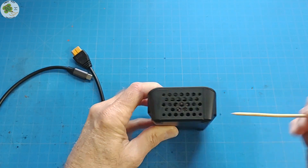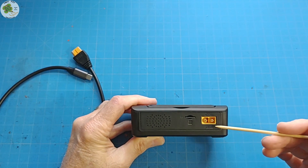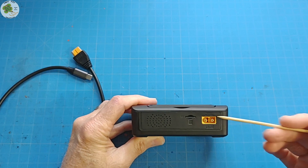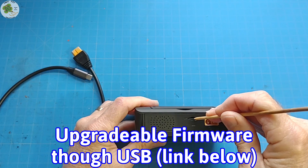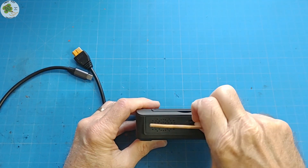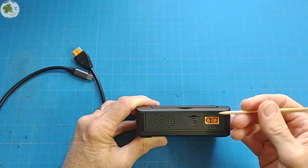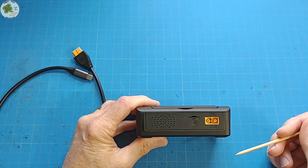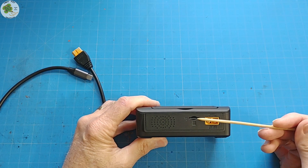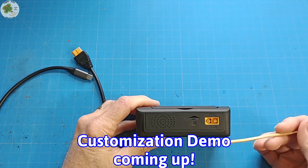At the back of the Toolkit-RC M9 charger, you have an XT60 connection for your DC power input which can take anywhere from 7 to 35 volts and a maximum of 25 amps. Next to that, you have your SD card slot, and the M9 charger comes with its own SD card. However, you may want to upgrade that with a higher quality name brand — I usually go with SanDisk 16 gigabyte SD cards, linked below, for between five to ten dollars on Amazon. The SD card contains your startup or boot image and your audio files, both of which you can customize.